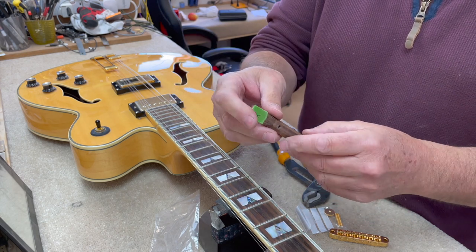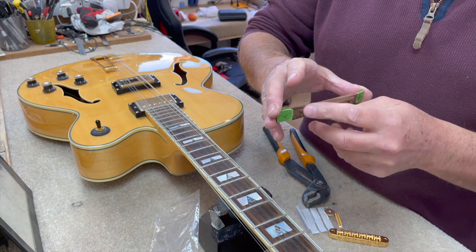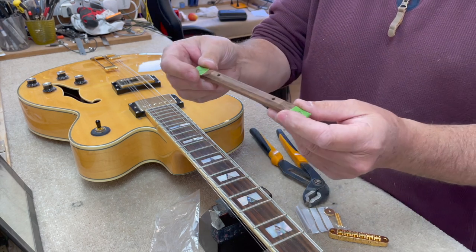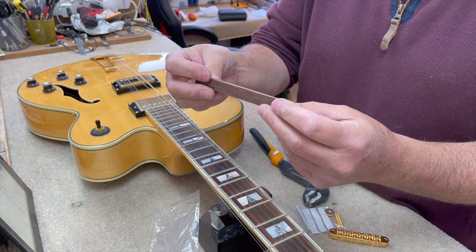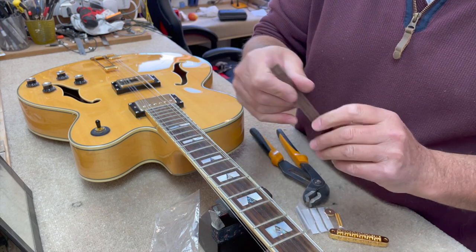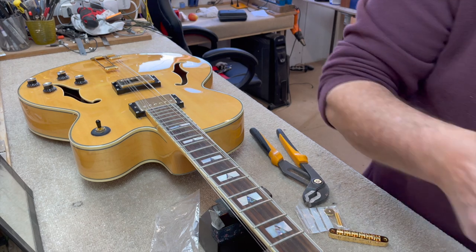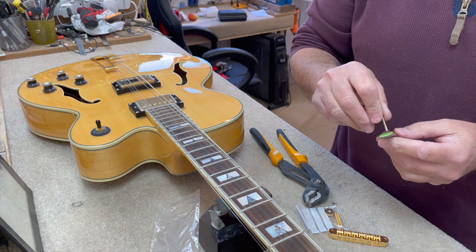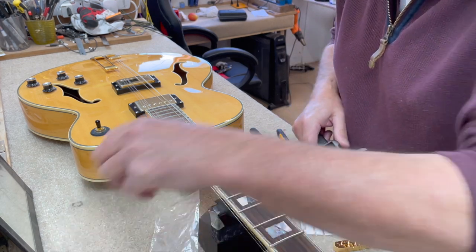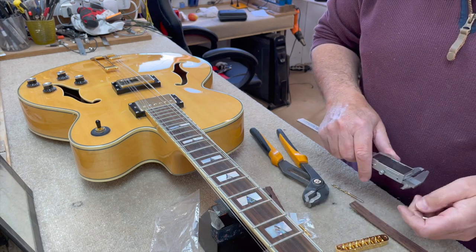Now, I think I would probably do it on the sanding drum, just take away this whole area here, and then I will go back to a flat block and sand this out. And then we just need to make sure that we've retained the position of the holes, or extend them. In fact, probably the smartest thing to do is extend them through now to the other side. Now this is not the right gauge. Let's see what the gauge is. These are very tall, so they're a bit too tall. We could use them, but we'd have to cut them.